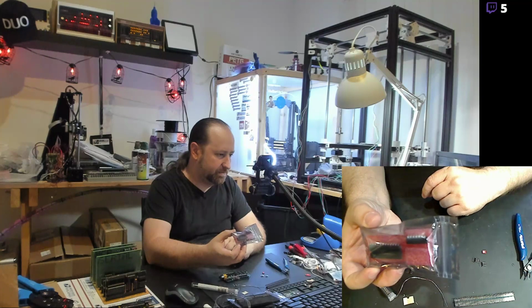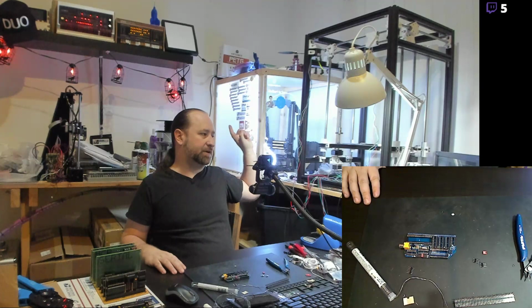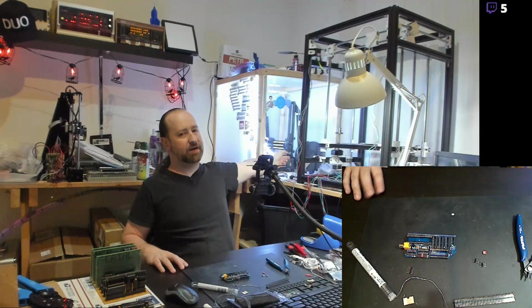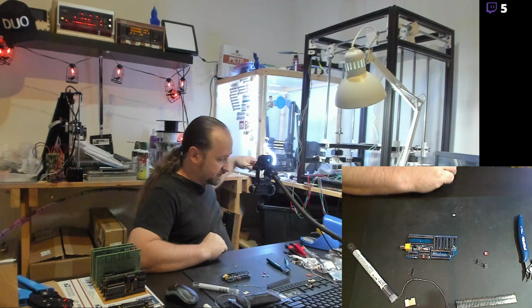Yeah, PETG is great if it's dry. Actually, I have found that the Hatchbox PETG is okay wet. In fact, this roll that I have in the enclosure right now has been in 40 to 50% humidity for about a month without being sealed. And it's still printing, like, it's printing nice.